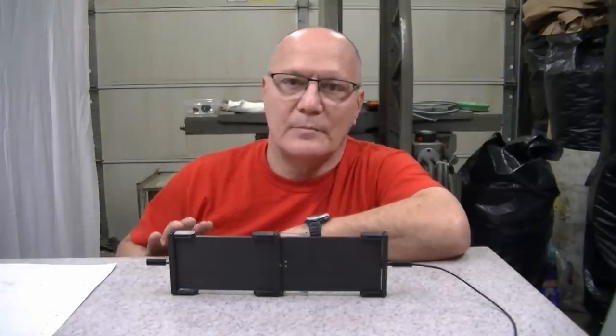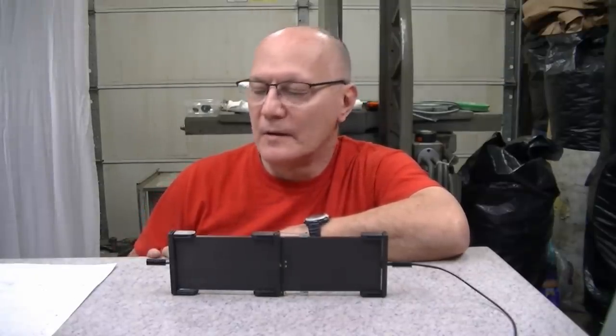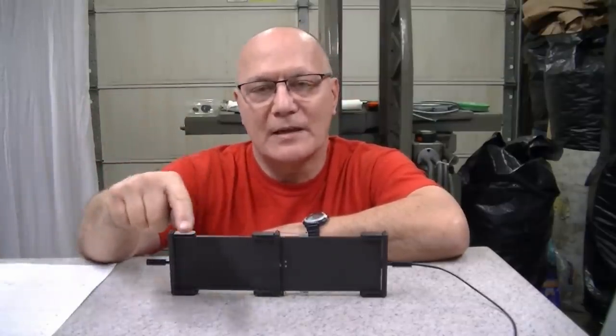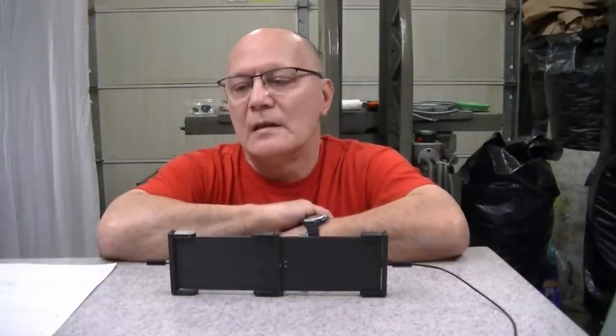This eight-inch thick pink granite plate is flexible — it is moving. Anything you do, push your finger down here, it's bending very small amounts. Never think of anything as rigid. This is also an opportunity to talk about plate thickness: why is this pink granite plate so much thicker than a black granite plate? The modulus of elasticity of pink granite is much less than black granite or gabbro, so it needs to be thicker to satisfy the deflection test.